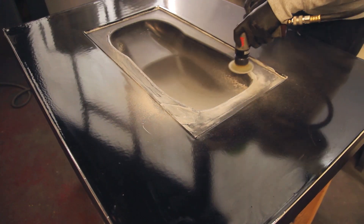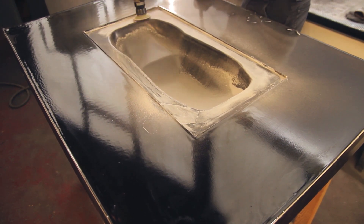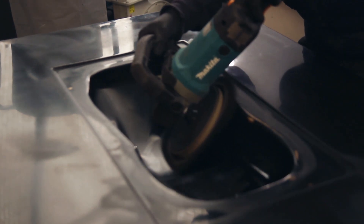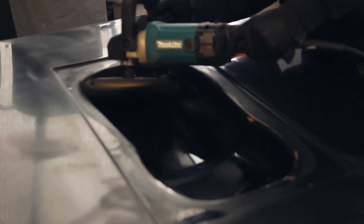Mostly use the same materials. Don't sand too much in the same place — your gel coat might overheat and soften, creating little problems. Then it's just back to sanding it flat and finishing it again, until you have your perfect mold ready to start making parts.